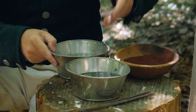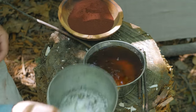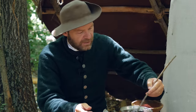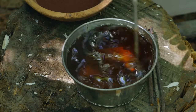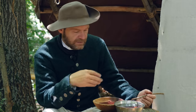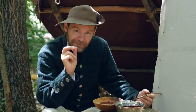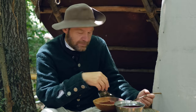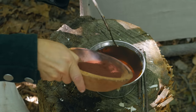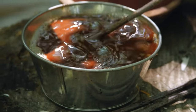So let's mix these ingredients up. I've got my boiled linseed oil and the turpentine or mineral spirits — I'm going to add that in there. I don't want to overfill it. It doesn't have to be perfect getting this mixed together just right. We do want to get it completely mixed, and it's going to be a lot harder to get this pigment mixed in — it'll take a little bit of stirring. The important part about this pigment is that it's very finely ground; it should be as finely pulverized as possible. This iron oxide is nice and finely powdered and it actually mixes pretty well.